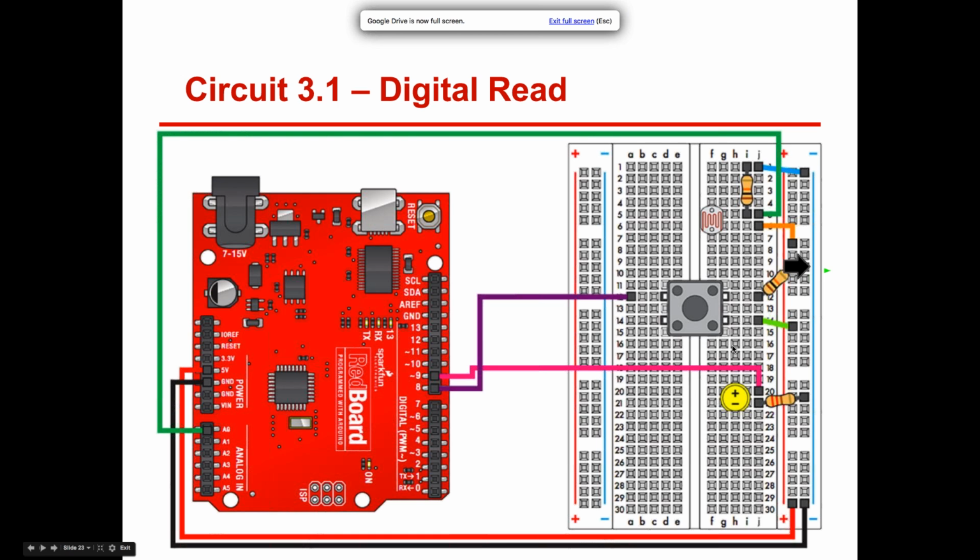Maybe this will help. You see a lot of pull-downs generally. All right, now see, look at this. What's going to happen? Here's current. It goes to this button. Now, if nothing else is happening, it can go up here, it can go out this ground, and you complete a circle going around and around and around. When I press this button, it has a choice. It could either go here or it can go here. If it goes here, then we're not going to get the full voltage in the pin, are we? So we want this to be a 10K resistor. So we know this is higher resistance than this path is here. So when I press that button and that current goes up to here and jumps across, it's going to go right to there. Hope that makes a little more sense. That helped, Daniel.